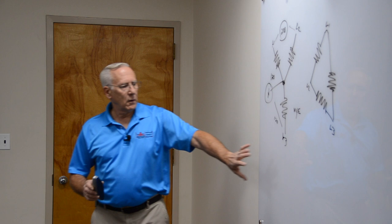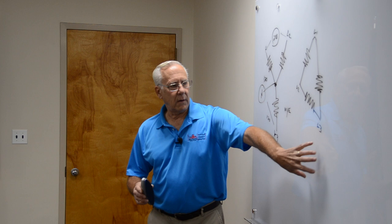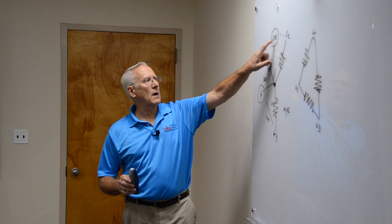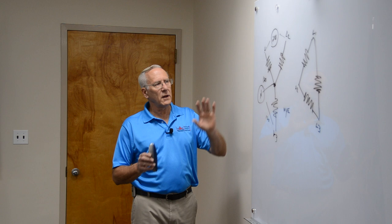For right now, I just wanted to explain some of the systems that are out there. This is your school power. This is your industrial power. Not that you need to know that, but just so you understand that there's a reason for each. Heavy loads, because this has a higher power factor. This has a lower power factor. It's neutral because what happens is it drops the voltage to 208. Normally, these voltages between phases are 240. Here, it's 208 because of this neutral. But you don't need to memorize that. You just need to know that's what's happening.